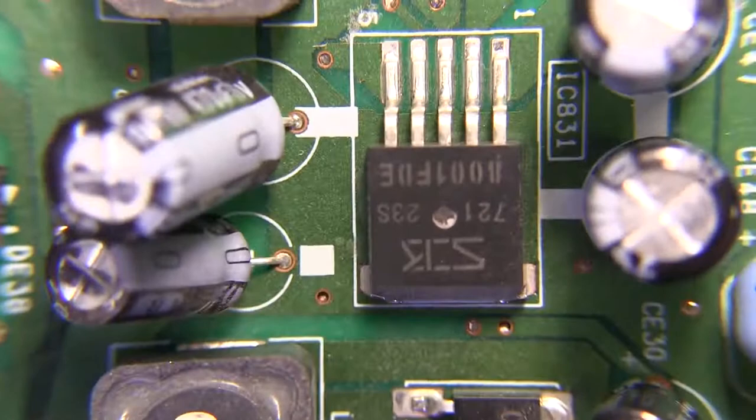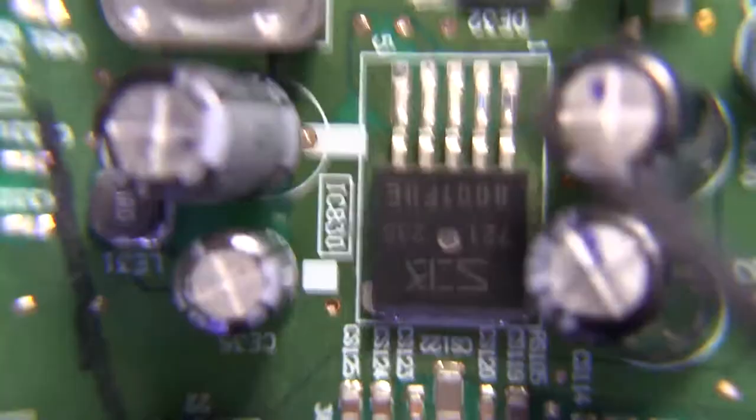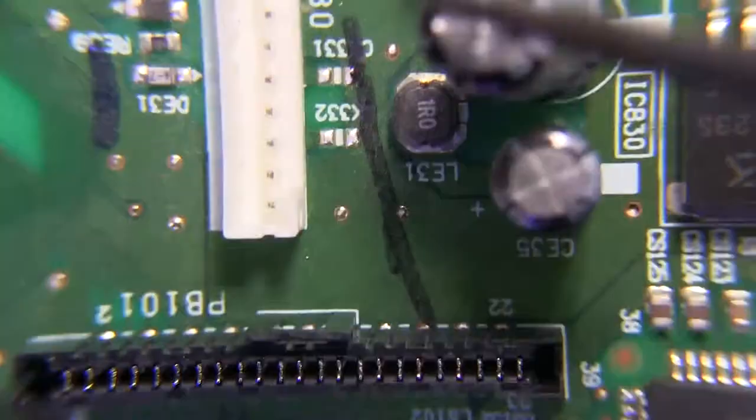Other stuff on this board: we've got some switching regulators — you can tell because they're all attached to a small coil, like a choke. It's more efficient to have these than linear regulators on heat sinks. All the outputs of these regulators go off into this connector, and this is what powers the big digital board. The other last chip on this board is made by JRC — Japan Radio Corp — and it's an NJW1180AF. Basically this is an audio processor with I²C control, controlled by the microcontroller on the other section of the board.